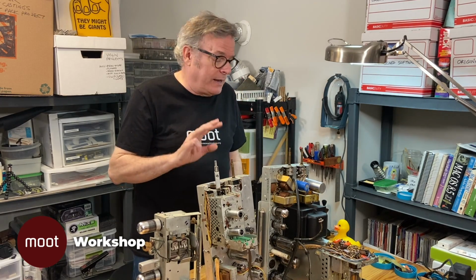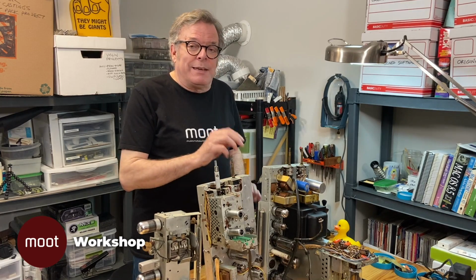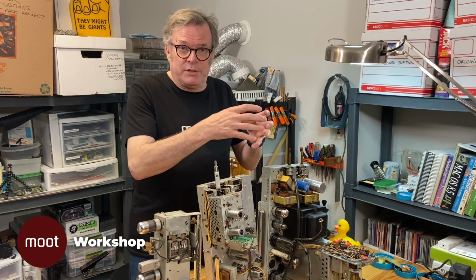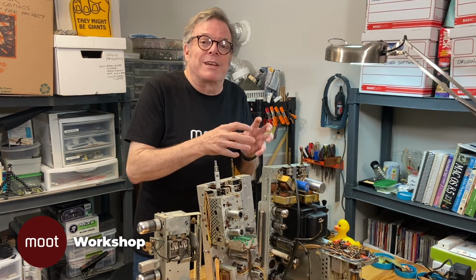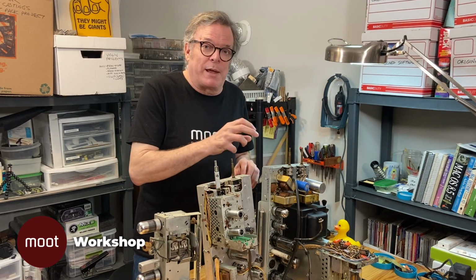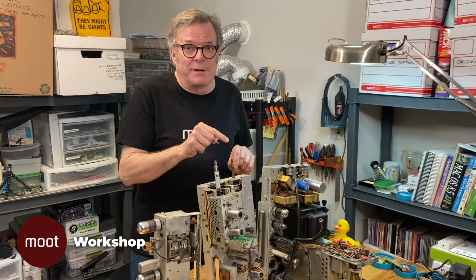And the last thing is, when I was looking over here, there's a note on the back of this saying not to try to operate it without the deflection yoke, which is the coils that go around the neck of the picture tube, without those connected, because supposedly it'll damage some of the components. So we need to make sure we hook that up, and that's still hanging on the picture tube. So let's go take a look at that.